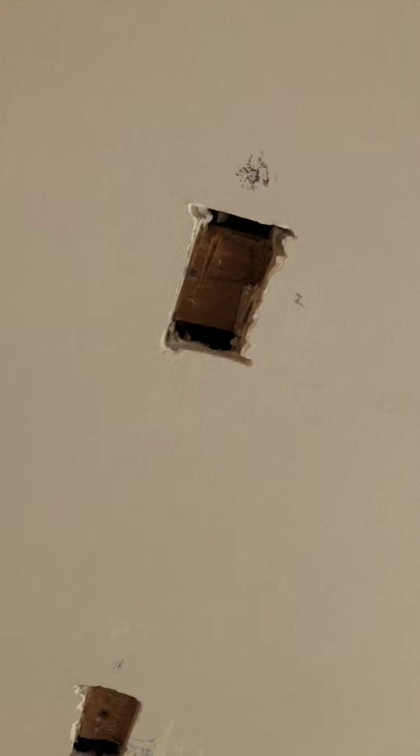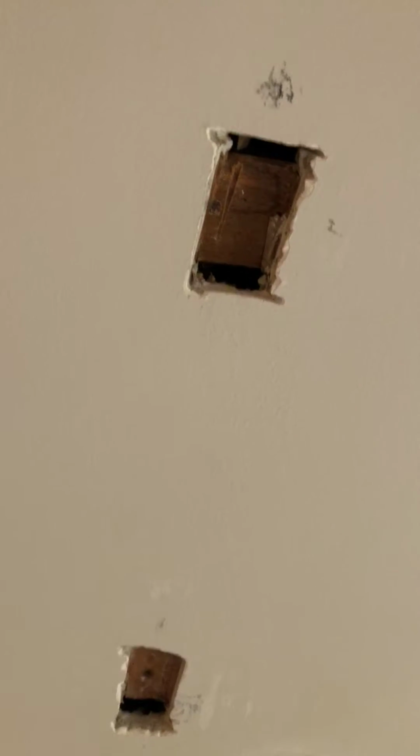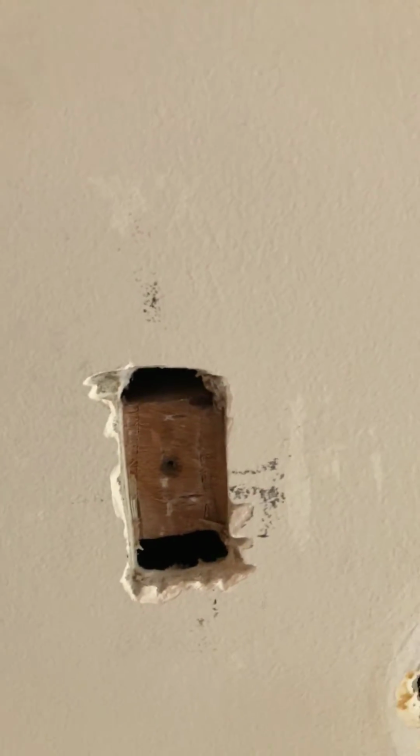This is the dining room, and even though the house was built in the 30s, there's still cloth conductors. It's not actually a single conductor knob and tube. It's a cloth non-metallic sheathed conductor. Both of them are cloth inside of it. There's no ground. And this is rare to see a house in the 30s having 2.5-inch by 10-inch boards.